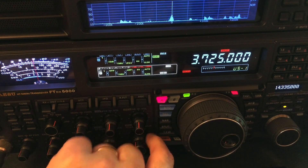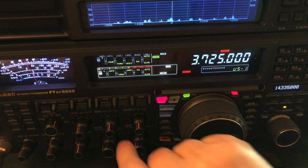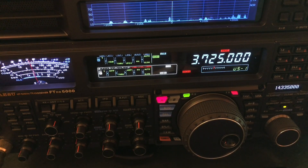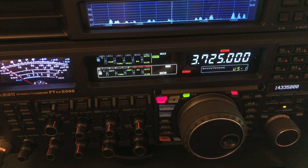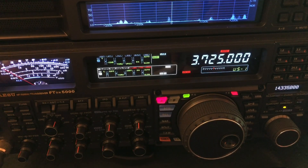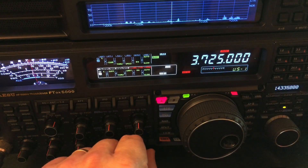Now I'm going to do one more thing — I'm going to rotate the RF gain knob. Let me explain. What I'm showing you right now, all radios have some variation of this. You'd be hard-pressed to find a radio on the market now that doesn't have the ability to do attenuation and intercept point optimization. Some radios may not call it IPO — in some cases it may simply be no preamp, preamp 1, or preamp 2. But the principle I'm showing you here can be applied to other radios, not just other Yaesu's.